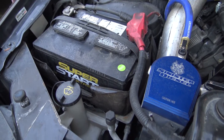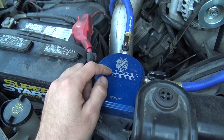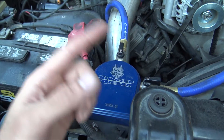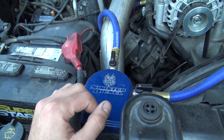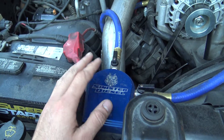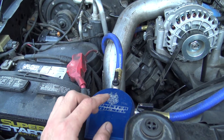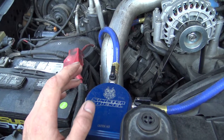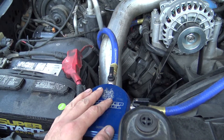Starting on this side, this is aftermarket — I put that in myself. This is a coolant filtration kit. What it does is it skims off a little bit of the coolant every time it cycles through and filters it. There are little contaminants; people say when they flush their cooling system a lot of grit comes out. This is designed to catch that grit. You shouldn't need it if you have the extended life coolant like the CAT ELC, but it's good to have. I like to keep my coolant nice and clean, so peace of mind right there.